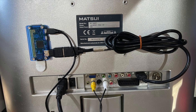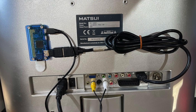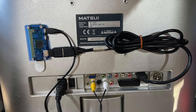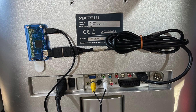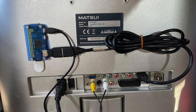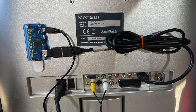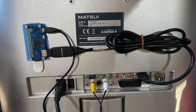Unfortunately this cheapo TV doesn't actually have a USB port, so at the moment the Pi is being powered externally by just a wall adapter. The code is really quite straightforward — it's a standard install of Raspbian, but it doesn't boot to the GUI, just boots to the command line. It then auto logs in, at which point it boots up VLC the video player, and as I said previously it just plays a folder full of videos.